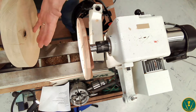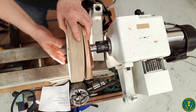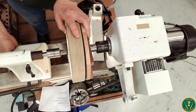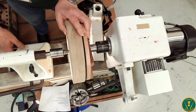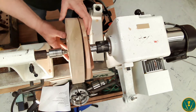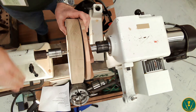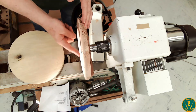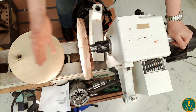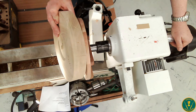Part of the thing with turning any platter like that is that you've got to have a mortise on both sides. When I do that, I just whack it up, bring the centre up — you know where the centre is going to be because you'll have done a centre mark when you started. It's a very simple way of getting your piece sorted out. You'll obviously get a few holes from doing it. By adjusting the screw tips to be only two or three mil, the holes are quite small. Some people just do a grip face with pressure grip, but I find that if you've got a piece of wood that's not perfect on one side, you can still get a grip even if it's a bit wobbly.